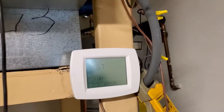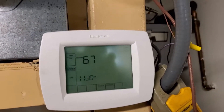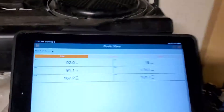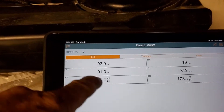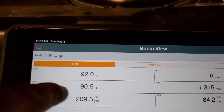I think I'm ready to run it using the Honeywell. I don't have any control over the on/off point — you can just change the cycles per hour, which kind of changes how long it'll run. I had the fan on continuous, so let's go to heat. It's 11:31. There are some thermometers over here — I'm using a couple different ones. I think the one reading 92 degrees is the one I have sitting on top of our minivan over there to show the temperature in here, and the 589 matches the one doing airspeed.